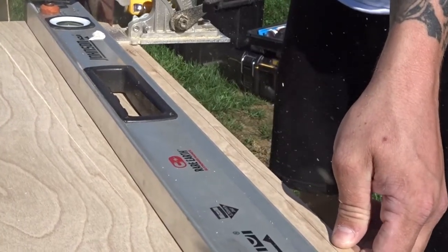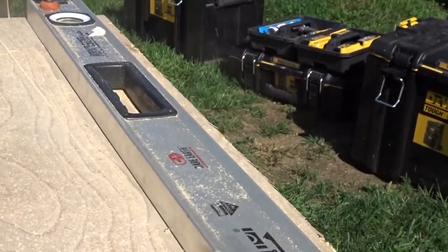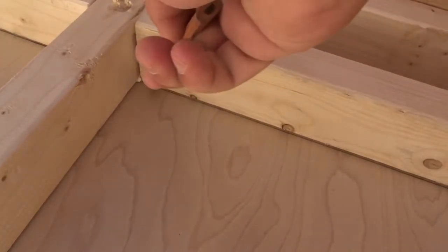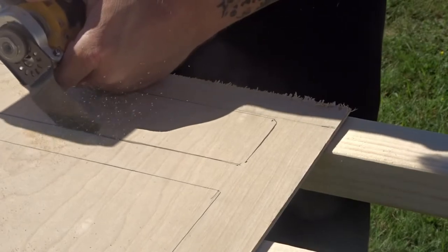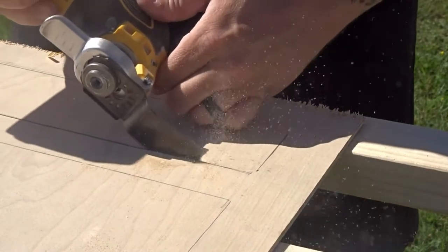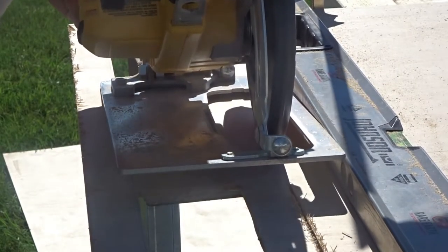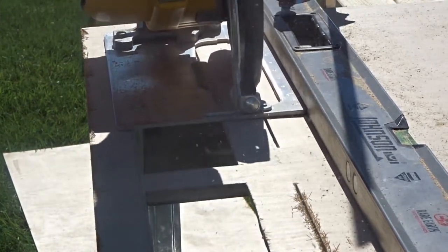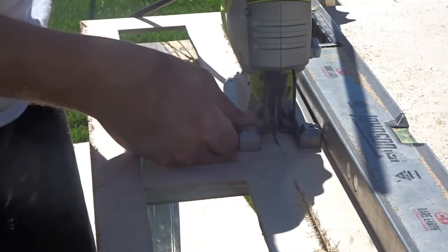After sanding, I finally figured out how I was going to finish off the front of the tank — again using quarter-inch plywood. I laid the stand down with the plywood in front and traced out all the holes. To cut the holes, you can use a multi-tool and finish with a jigsaw, or use the skill saw method. I chose to use a skill saw and made plunge cuts — be sure not to overcut. I then finished off the cuts with a jigsaw.